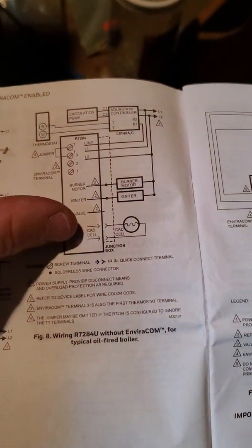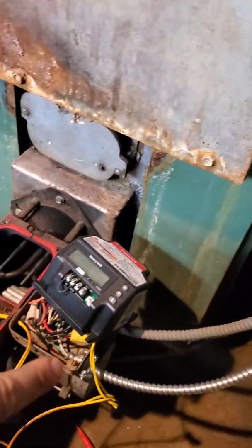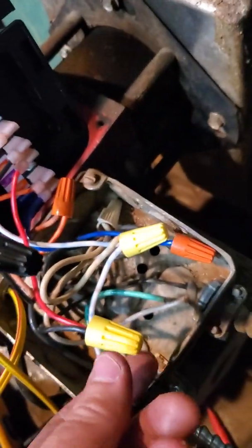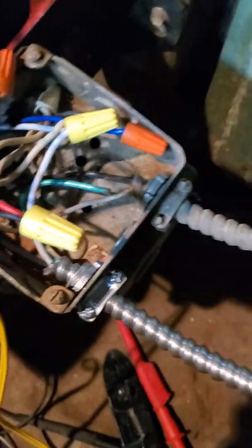With this, I had to add on another hot wire. So your limit is coming from B1. There's my B1, and that's coming down underneath here - B1 is feeding your limit. So if we look, that's the red wire here. If you see limit, that's connected right here, and that's coming in on my B1. I had to put this guy in here, and this is a total hack job. I got my ground wire there.